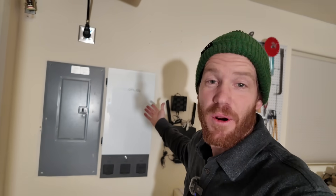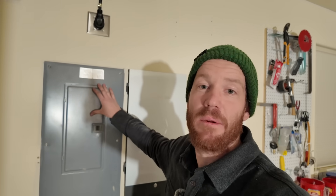This is how it works: our grid power still comes into our main panel where most of the home circuits still exist. From here there's a circuit breaker and we transfer 100 amps into the Smart Home Panel 2. The Smart Home Panel 2 is the hub that allows us to integrate the entire home into EcoFlow portable products like the Delta Pro Ultra or also the Delta Pro.